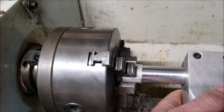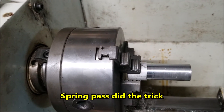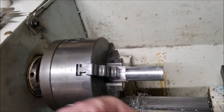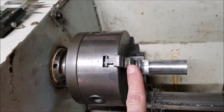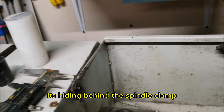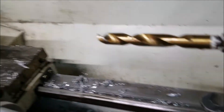We've got the OD of our drag engraver holder turned down and it slides in there really nicely — a little tight, so I may just clean that up with some sandpaper to get a nice fit. It's pretty hot too. The next thing to do is put a chamfer here, then drill a hole all the way through and probably bore it out on each end so I have a specific number to turn the end pieces to. It looks like I've already lost one of my end pieces, so I might have to use the white nylon — which I hate — but onward and upward.